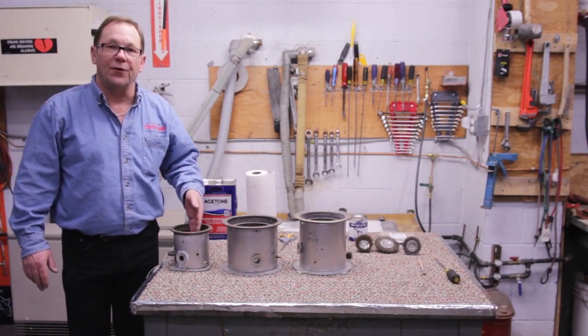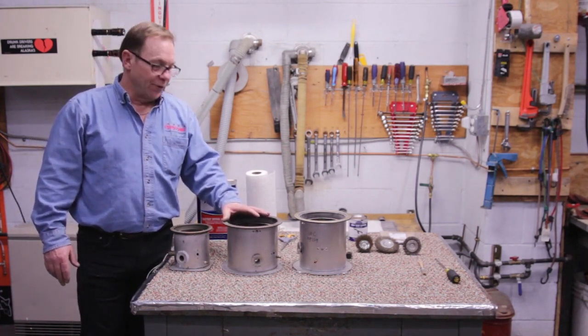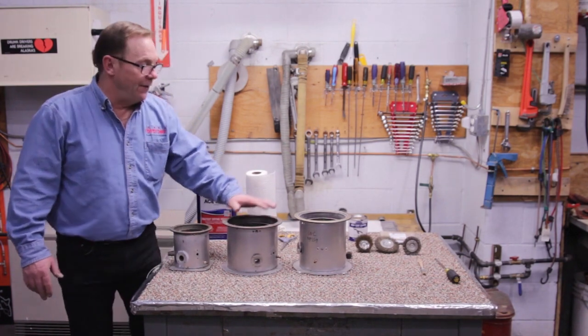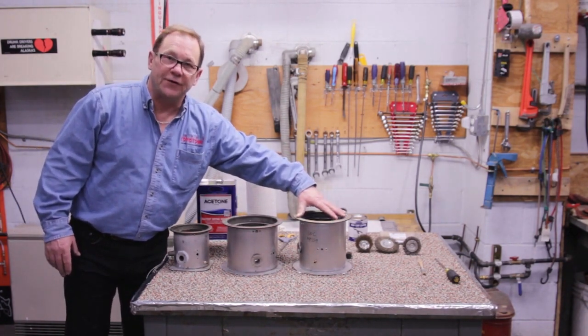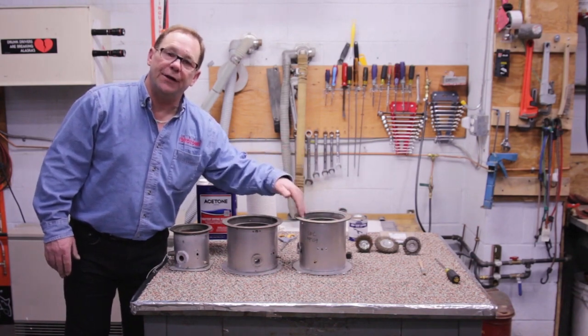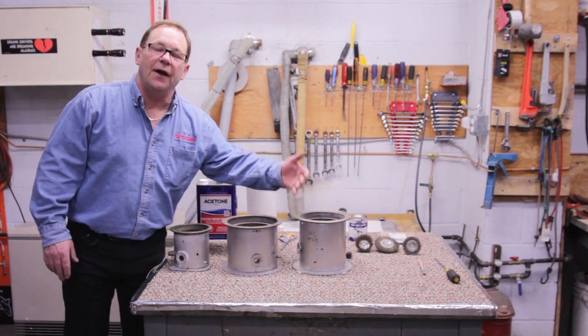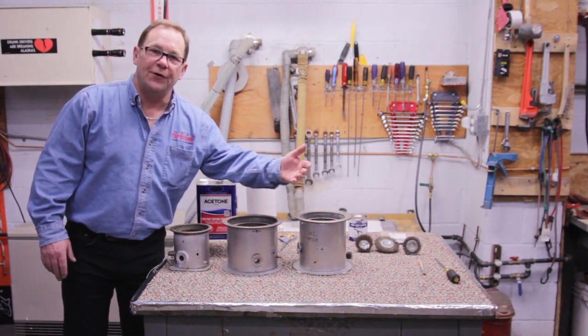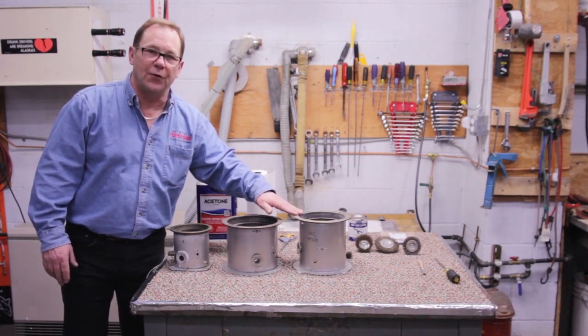It takes a small burner mat inside of it. We have the 73 730 burner, and it takes a burner mat. This burner right here is for a 56 560. It takes a burner coating, not a burner mat. The 60 AT takes a burner coating, and the Laser 530 OM2223 both take burner coatings, not burner mats.